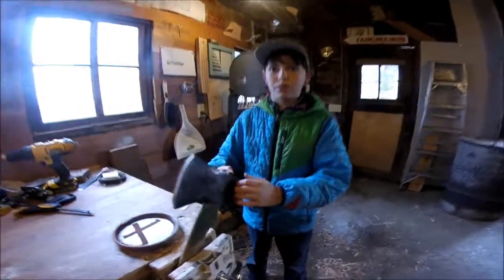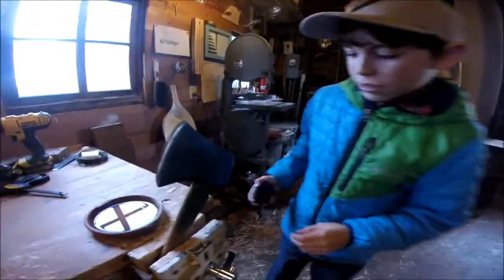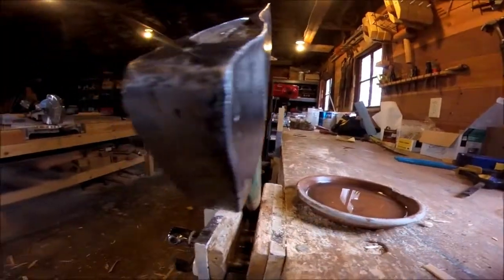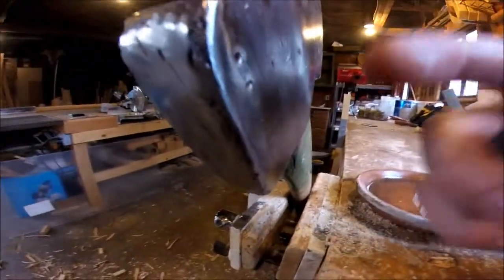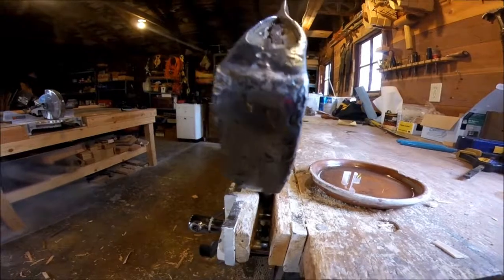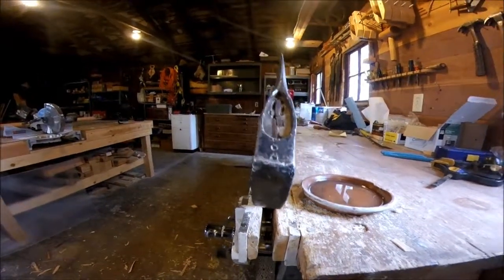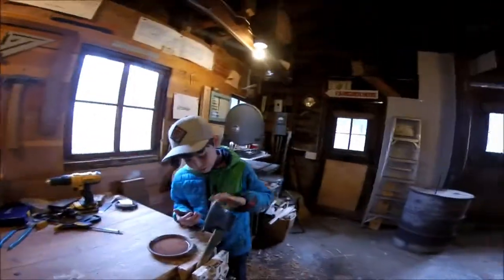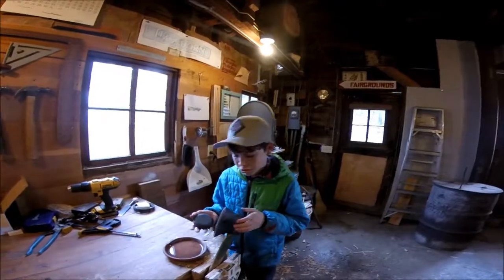It was all mushroomed out on the edges. Well, it was all mushroomed out, so I filed it down. On the back it was so bad I had to take the angle grinder to it. It's nearly a mirror polish now. I had to kind of scuff it up because the mirror polish looks weird with the aged metal, so I just took a wire brush to it.